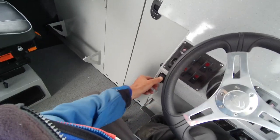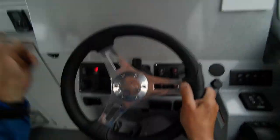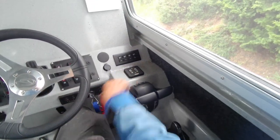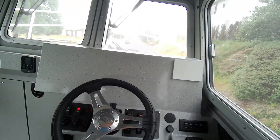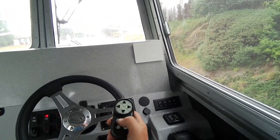That's your sensor for like if you had water coming in — if you're anchored out at night, that'll go off. That's your mid cabin, that's under here. Courtesy lights are these lights right here. Deck light anchor — that's working. Nav lights work. Wipers — all three. Horn. Forward bilge, center bilge, rear bilge. Key switch, port, starboard start, trim tabs. Right here's your other remote — you got one remote for your left, one for your right. And you can always get on that step back there. If you're not sure if they're off, I would personally like to have a switch up here on one of these accessories where I could hook into those lights — so even though I powered this off, I hit a switch and it kills all power to those lights, because sometimes you think you've got it turned off and you don't.